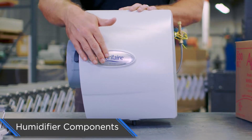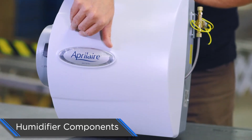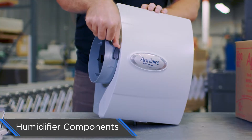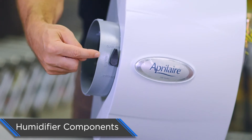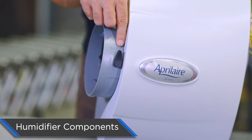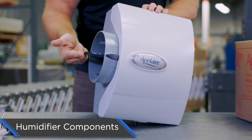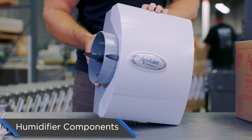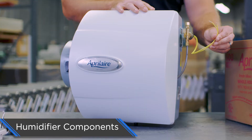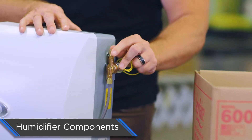Now we're going to show you how the components relate back to your evaporative humidifier. First and foremost, we've got our name badge. This can be rotated when you install so that the name Aprilaire is always facing up no matter which direction you install the humidifier. Over here you've got a lever — notice you've got summer and winter. When it's in the summer position, the damper is closed and the humidifier is not humidifying. When you rotate it to winter, the damper opens up and we're ready to humidify the home. We also have our lead wires for opening the solenoid valve; these connect to the 24-volt transformer and the automatic humidifier control.